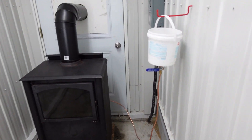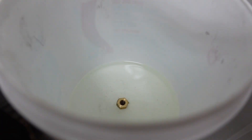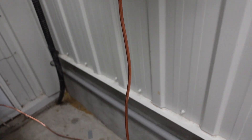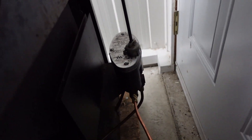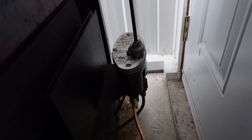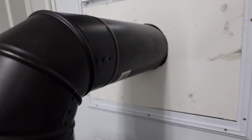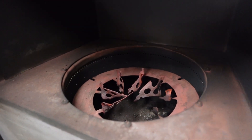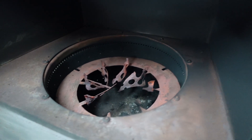We have a makeshift gas tank — we're going to put some diesel in here. It's going to flow through the valve — we're going to make sure this is open — and it flows all the way to the back here right to the regulator. We're going to keep this at setting number two or three and see how well it does. We have the chimney going outside, held up by a piece of wood since it's a temporary setup, going through the window. The inside of the stove is quite basic — this catalyzer is a little rough but it should still run.